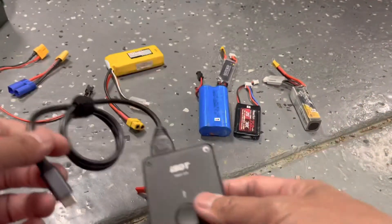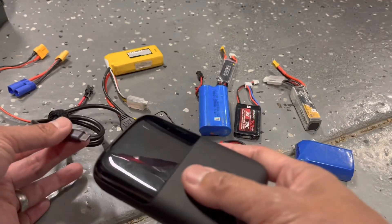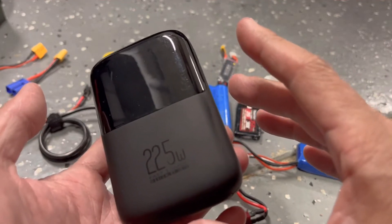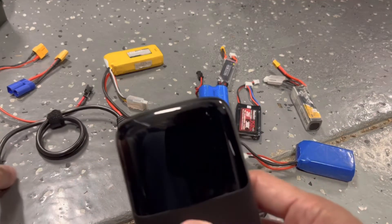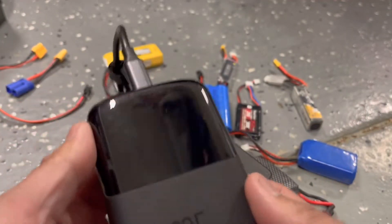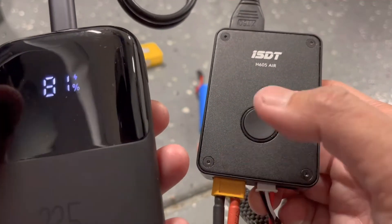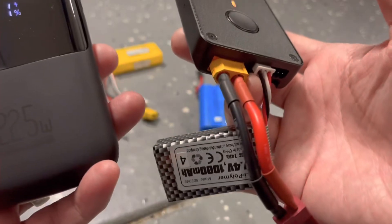The reason I plug this in first is that — and I'm not sure if it's a fault or feature of this particular battery bank — if I plug it in and don't plug the rest in quickly enough, the PD capability goes away and it drops to standard voltage, which is not high enough to operate the charger. So I plug everything in first, then plug the USB-C to USB-C cable in last. After that you should see a lightning symbol, and when you see that lightning symbol it means it is in PD charge mode. Then I press the button and charging starts right away.